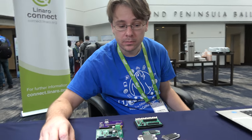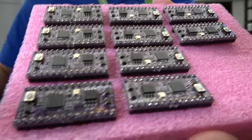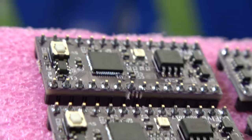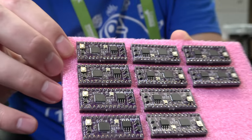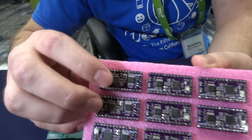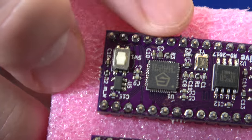And you have something running here with the RISC-V. What are you doing with this? This is the Low Five board. The Low Five is a RISC-V microcontroller — one of the first of its kind. First open hardware silicon, I guess they call it. This board pretty much takes another reference design and strips back some of the extra components, and breaks it out into a breadboard-friendly form factor. So you have a serial flash, the microcontroller here — that little guy — a reset button, some passives, and the crystal oscillator over here. It's hard to point to them because they're so small. This board actually plugs into a standard breadboard.